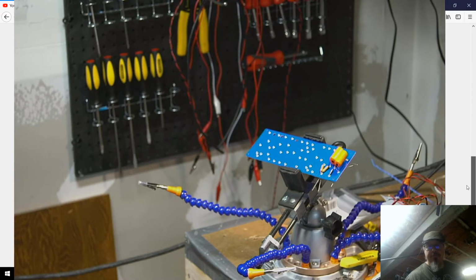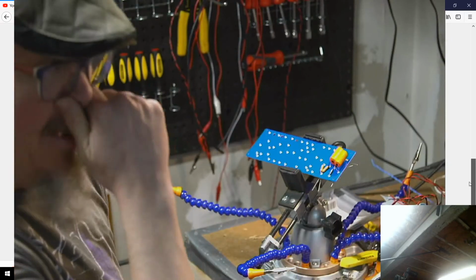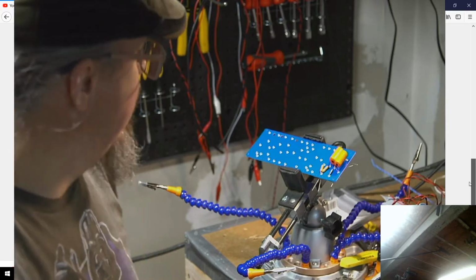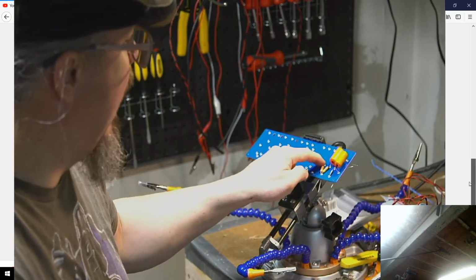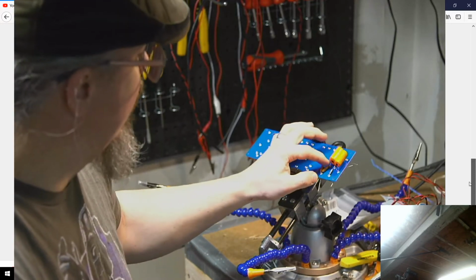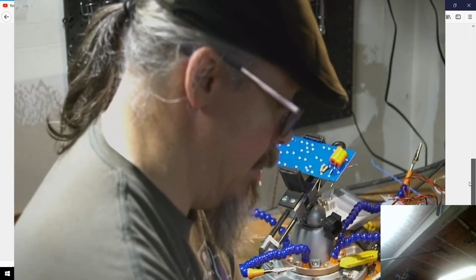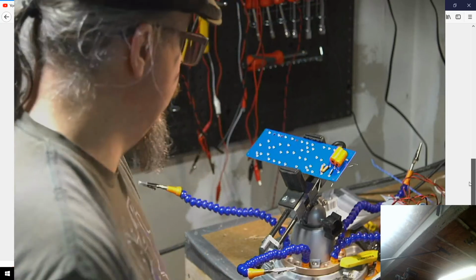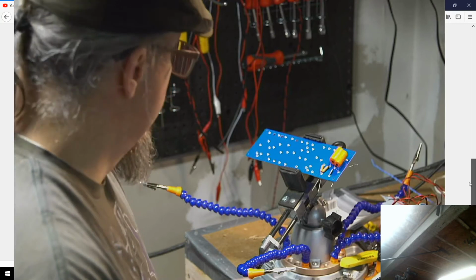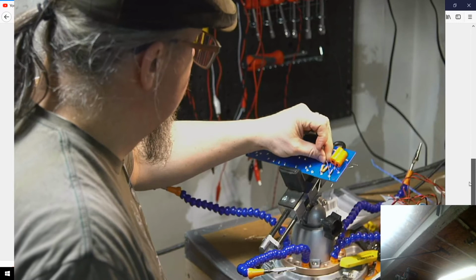The next thing, let's see. All right, so there's my two anode resistors that are coming off of that first tube, one for each half of the output. You'll see basically I'll bring in the high voltage here, and then this goes to one anode and this goes to the other anode. So this is the output. It's connecting in. I do need to do another jumper between here and here, so I'll get a small jumper together for that as well. And we will. Alright, and that goes from here to here, if I'm correct. Yes, it does.